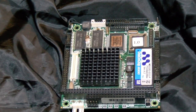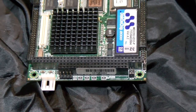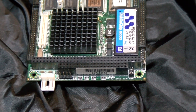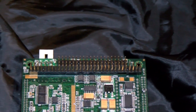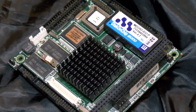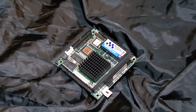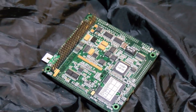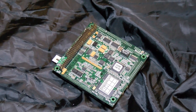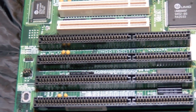Otherwise, there are different buses, just like a regular PC. In our case, this is a plain old PC-104, because it only has a regular 16-bit PC-104 bus. This is a parallel bus using IDC-like board-to-board interconnectors, and being parallel means you can stack the things up in just about any order. So what is the PC-104 bus, and why don't you really see it anywhere else? Well, you do — it's that same old trusty ISA bus from your regular PC, but with a different connector.